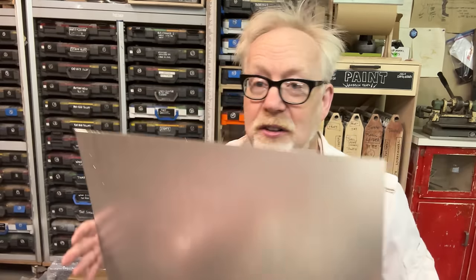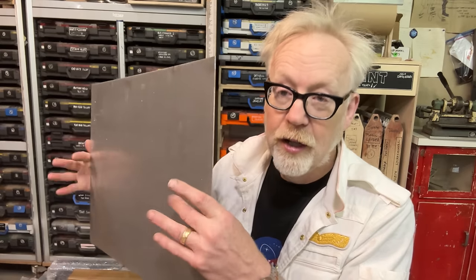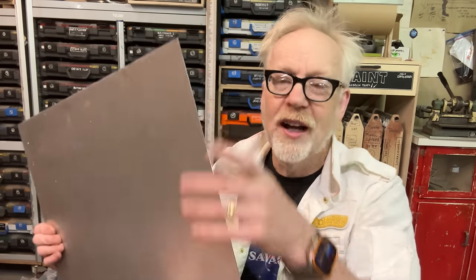What I'd like to do today is figure out precisely, I want to make this shelf. I have 2 pieces of aluminum to work with here at the cave. So I'm gonna make my corner cuts and hit this on the metal brake, make a shelf out of it and figure out my whole drilling pattern. So I'm going to basically use these 2 shelves to work out the production pipeline of making 65 shelves out of this stuff in something like a timely manner. Again, 65 of these, if you have an operation that is 2 minutes per, that's over 2 hours of work.